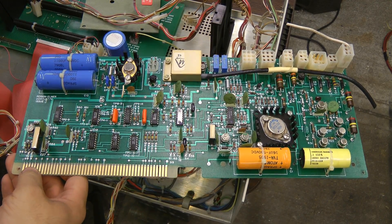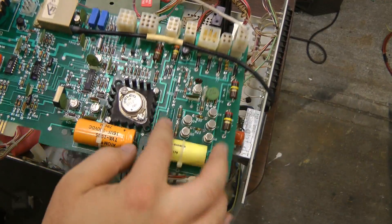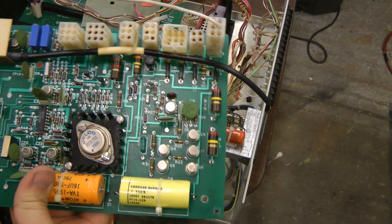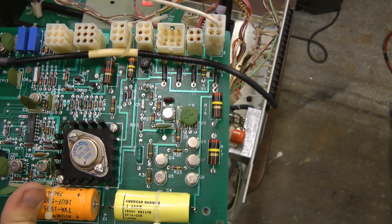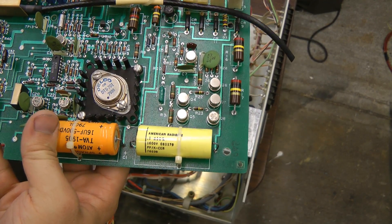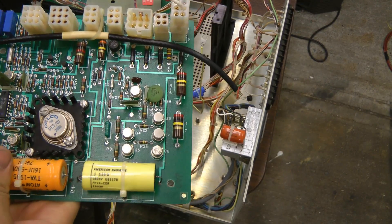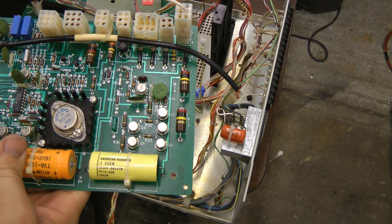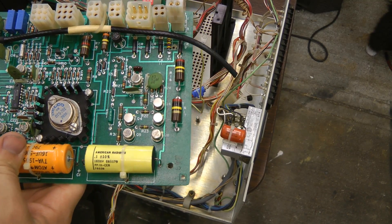This other board looks to be just a driver for the photomultiplier tube. On this side we have some power supplies. I think this section here is the high voltage power supply for the photomultiplier, which needs something like negative one kilovolt. I think this is the high voltage winding on the transformer, because I don't see any sort of switching power supply here. A few two-kilovolt diodes and a 1.6-kilovolt filter cap. I think what they're doing is basically just feeding the photomultiplier through a resistor and having a transistor pull the voltage down to regulate it, because the gain of the photomultiplier is affected by the high voltage, so that has to be regulated accurately.